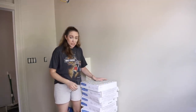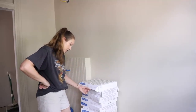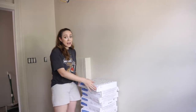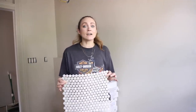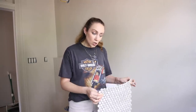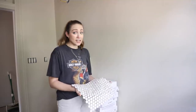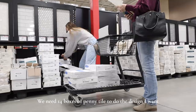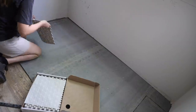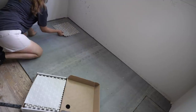I have 14 boxes of penny tile. We did all of the measurements when we initially bought the tile — coverage area per carton is 10.6 square feet, so we did the math and we needed 14 boxes. Every tutorial I've seen online about laying penny tile, everyone lays out the penny tile first, gets all their pieces cut, and lays it all out. This tile doesn't require spacers because it's on netting, so it naturally spaces the penny tile apart. I got it at Floor and Decor — it has alternating shiny and matte penny tiles and it's really pretty with a contrasting grout. Let's lay it out and figure out our plan of attack. I want the edges cut, so when we lay it out I want to put it away from the wall.